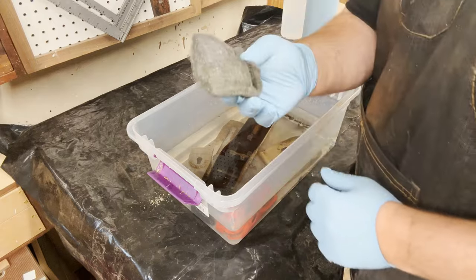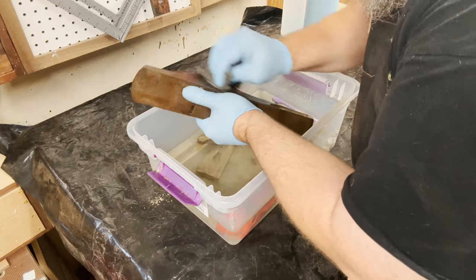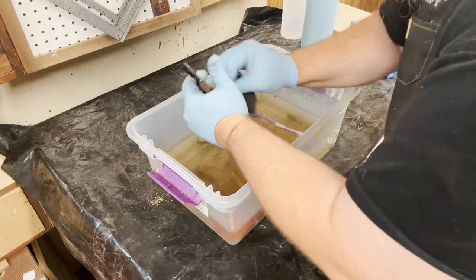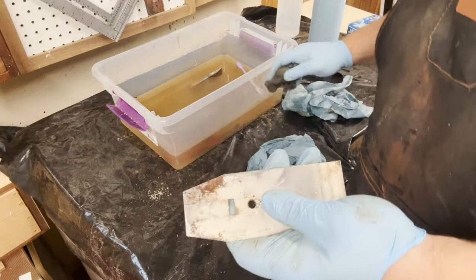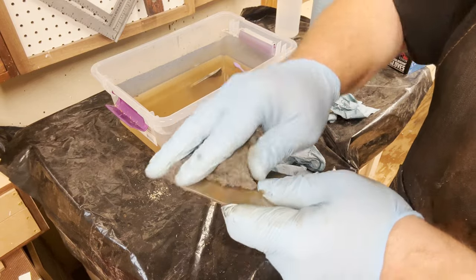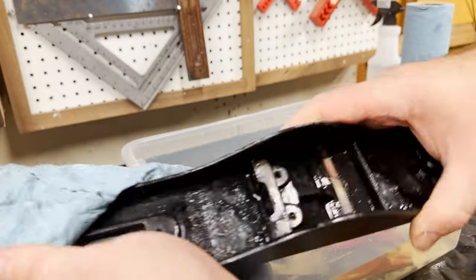This part is all about elbow grease. As I take my steel wool and start cleaning these off, with a little bit of time — probably about an hour and a half to two hours — you will see the vinegar liquid get more and more red. You're going to see just how easy the rust comes off. You could have done this with a commercial store-bought de-rust product, but this is a hundred percent natural and I got it at the dollar store, so it cost me two bucks. Now you'll see the bed here — one side's pitted, can't help that, but the other side's really clean.